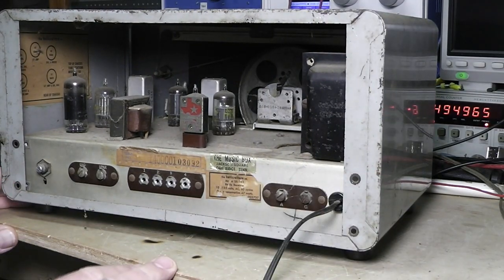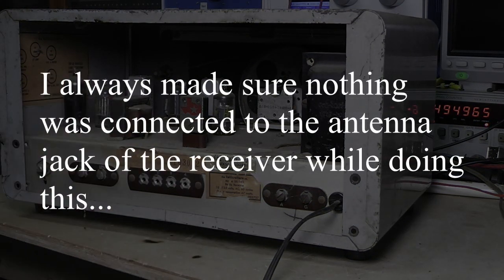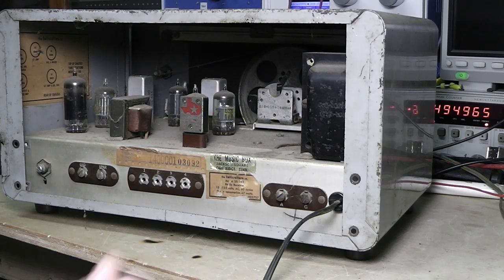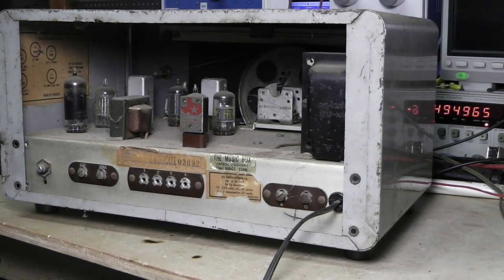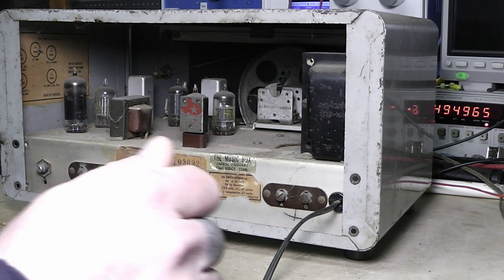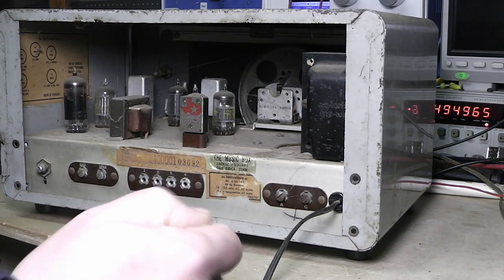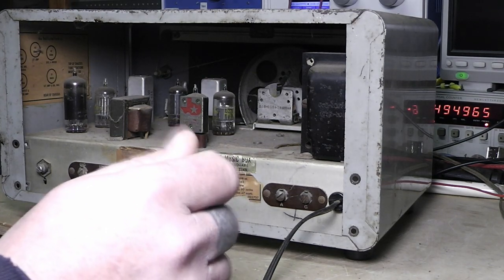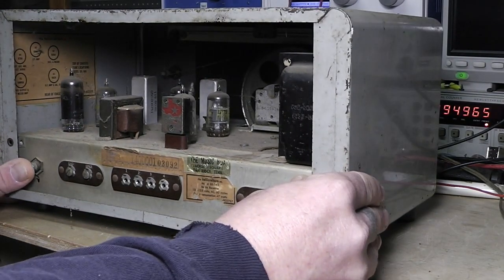But I would put the transmitter on, flip it on, and tune the receiver to make sure it was right on 3710. That's how I'd make sure it was on there. It wasn't one to one, so when I'd turn that thing, you'd barely touch it and you could go off several hundred hertz. So you had to really be careful with it. Barely just bump and touch that potentiometer. It was pretty interesting.